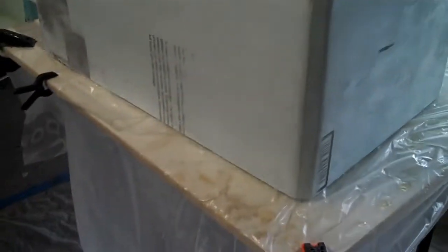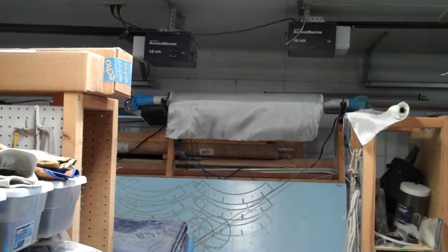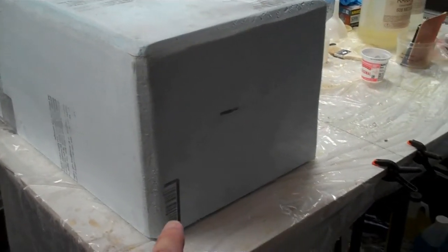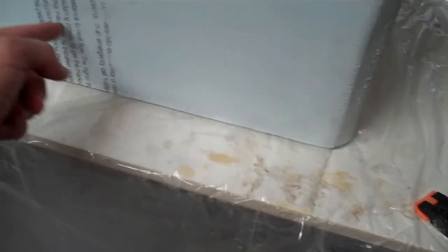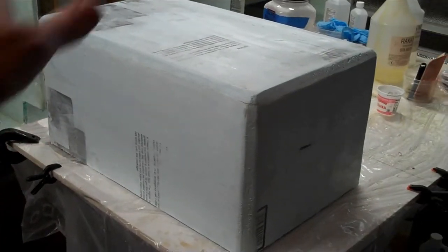A little bit of work with 80 grit sandpaper and those corners are pretty nicely shaped to have fiberglass cloth just roll right around them. The width of my roll of fiberglass is basically 39 inches, and going the perimeter around this way is about 40-41 inches - so it doesn't quite work. But I'm going to make it work by taking advantage of the fact that I'm going to be putting the drawer front on the front of one of these two sides, which has a nice big piece of cedar there, so I won't need fiberglass going all the way down both sides. I can have fiberglass end a couple inches up on one side, and when I put the drawer front on top it'll have fiberglass on the back plus the cedar board for strength.